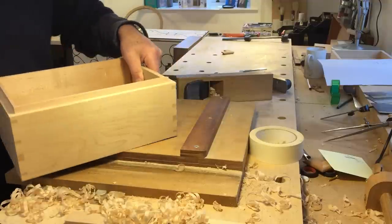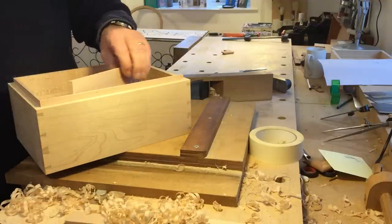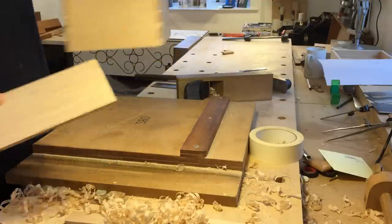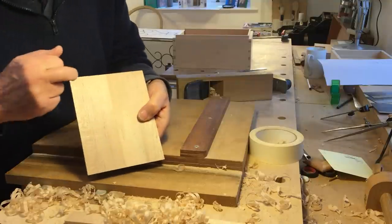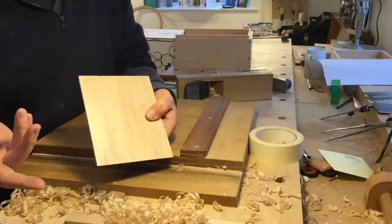Got linings in a box here. We've got another lining here which is a shade too high, so we're going to cut a bit off this. I'll show you how you might actually do it. I've marked a line down the job there and I'm going to saw this piece off with a tenon saw.